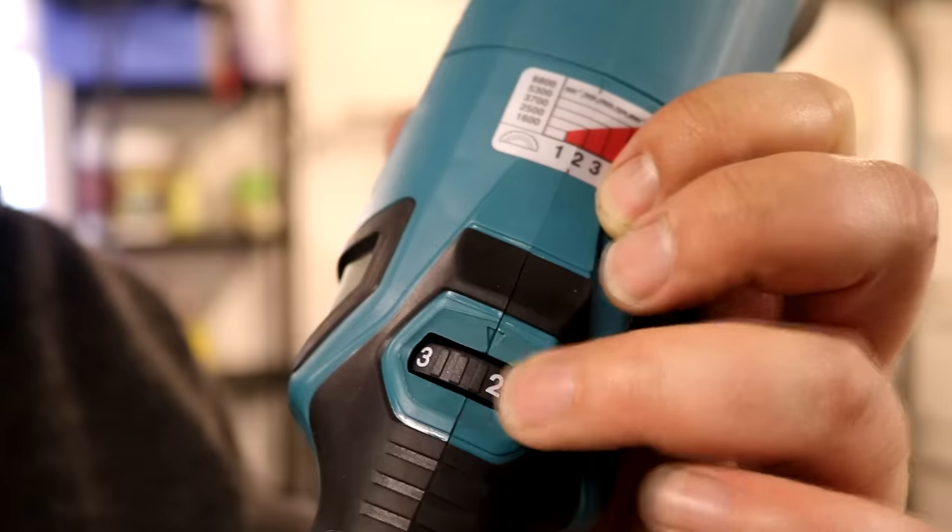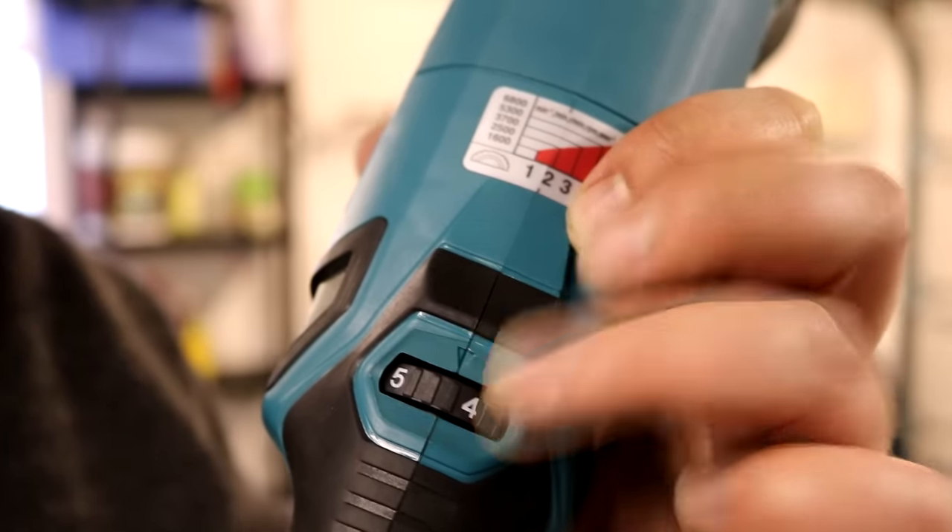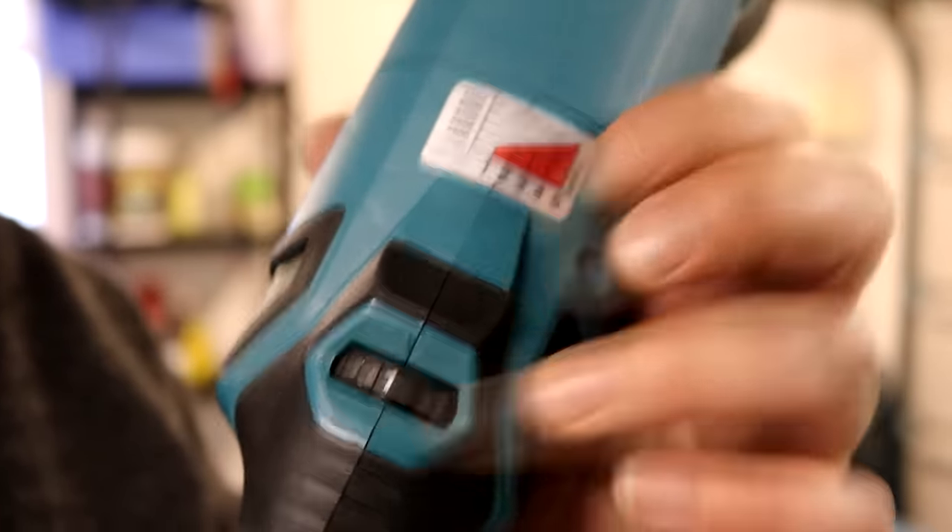Let's quickly run through the rest of the specs. It's got a 900-watt motor and weighs, according to Makita, 2.8 to 3 kilograms — I put it on the scale and it came out at 2.92 kilograms. It supports a 150mm plate and 125mm — it comes with a proprietary 150mm plate, and you can swap it with compatible plates down to 125mm, which most people will want to do. It's less of a handful with a smaller plate and that's more of a standard size now. The OPM range — oscillations per minute — is 0 to 6,800.